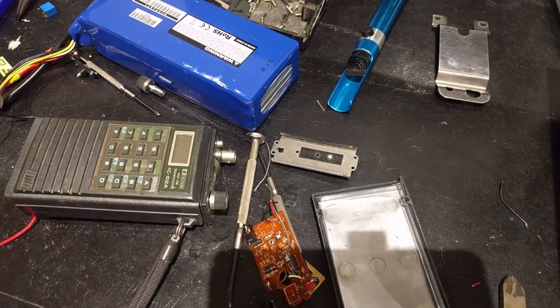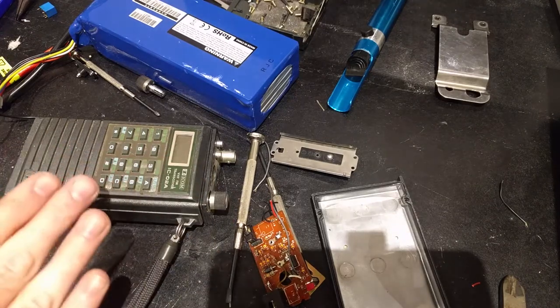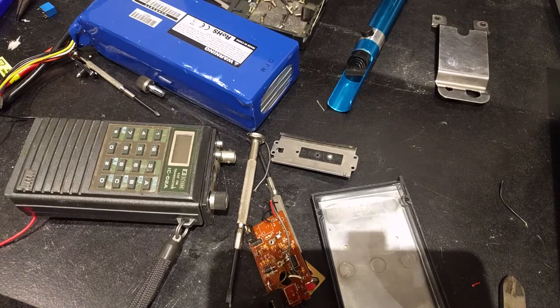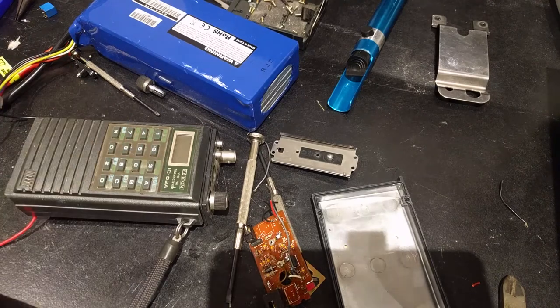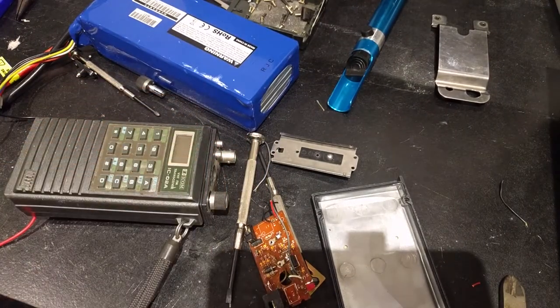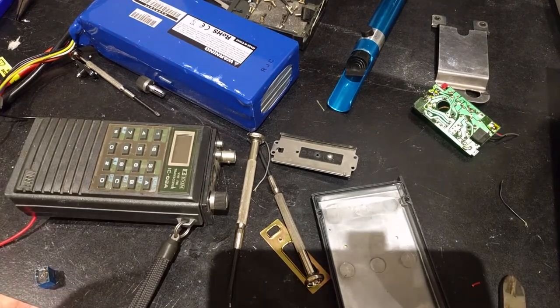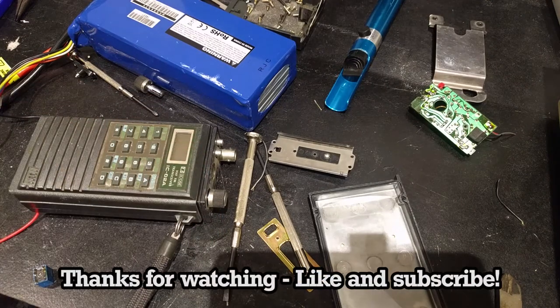This is a lesson, YouTube. What I should have done is when it was screaming like that, I should have just turned it off, left the battery connected, and let those capacitors reform and do whatever they needed to do — because electrolytic capacitors can sometimes come back for you like that. Unfortunately what I did is I went in there heavy with a soldering iron, clearly made things a lot worse, and probably destroyed these little relays — which is a shame. But we did get to look inside a very cool old radio, and sadly we did kill it. I hope you enjoyed the video — got some cool stuff coming up. See you in a fortnight. TK out.